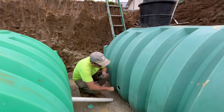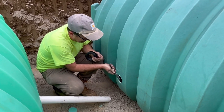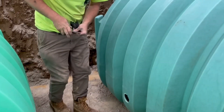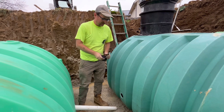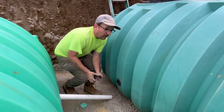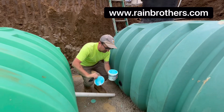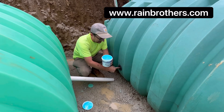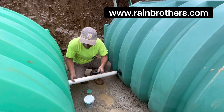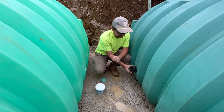Once we clean up this hole, we're going to pick a tank to push from — in this case, we're going to push from this tank. So I'm going to put the gasket on the outside of this cistern. We're going to put some of our blue lube — this is a specially formulated pipe lube for drinking water systems. Then I'm going to get inside the cistern and put this gasket in from the inside of the tank so that they're facing the same way.